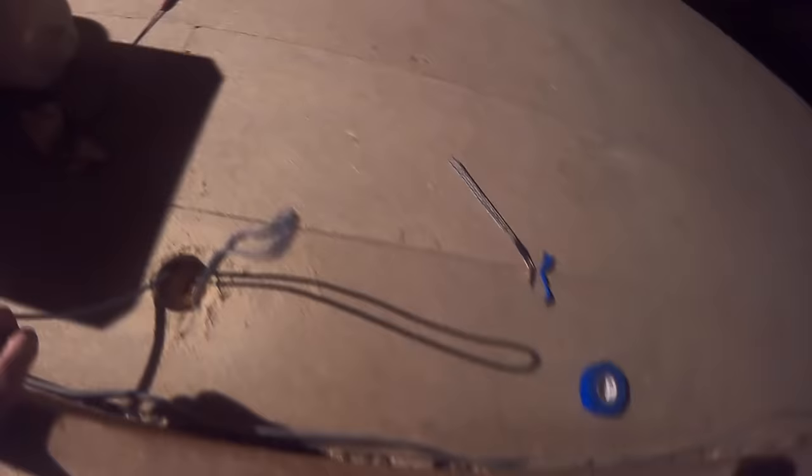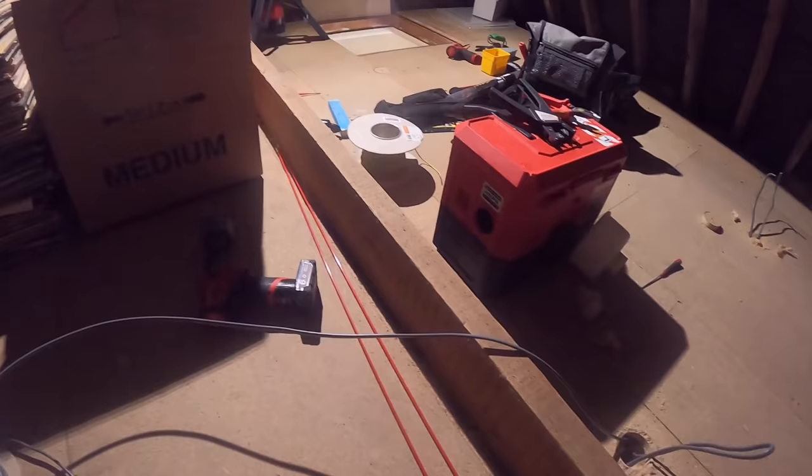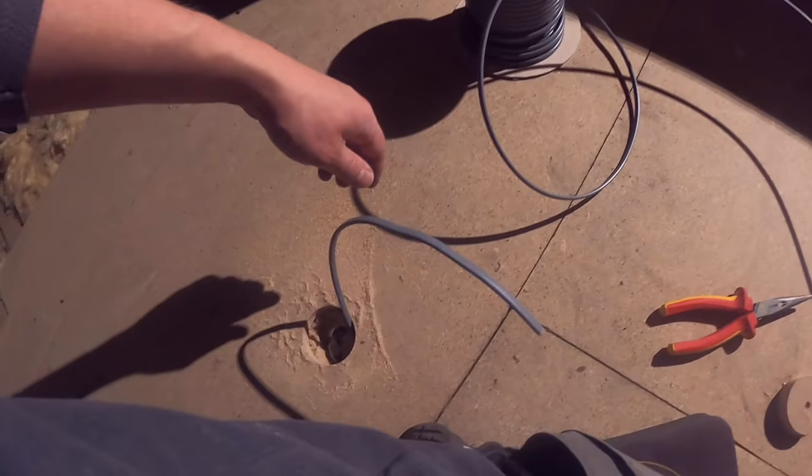Right, James has gone to disconnect and isolate the lighting for me, which is this one. You'll probably hear the plasterer shout in a minute. We're then going to pull this one back under the floor to this one, so there's no joint needed on this one, which is nice. That's what I did on the other one, put the Wago box under the floor. This plasterer shouting. Has it gone off? Yeah, all right, mate. Just for a few minutes, mate. We then got to get this cable under to here. Then this one will carry on to our next set of lights.